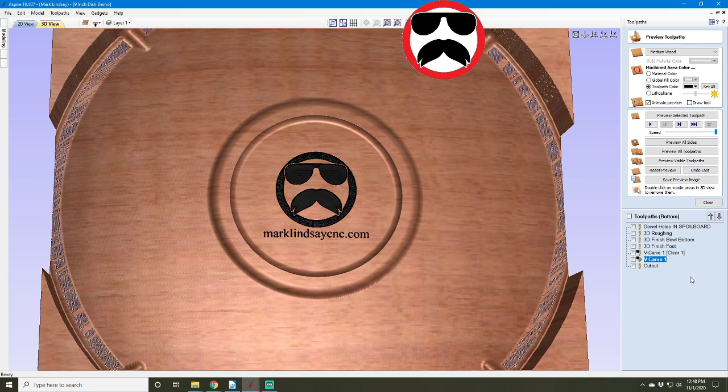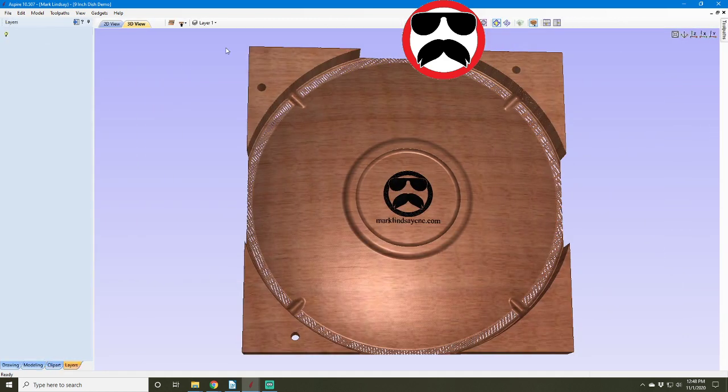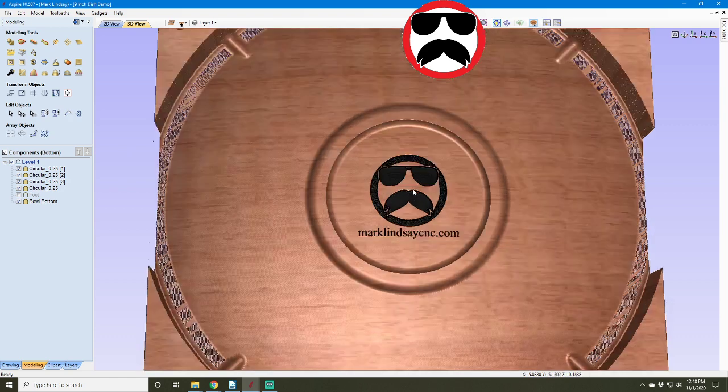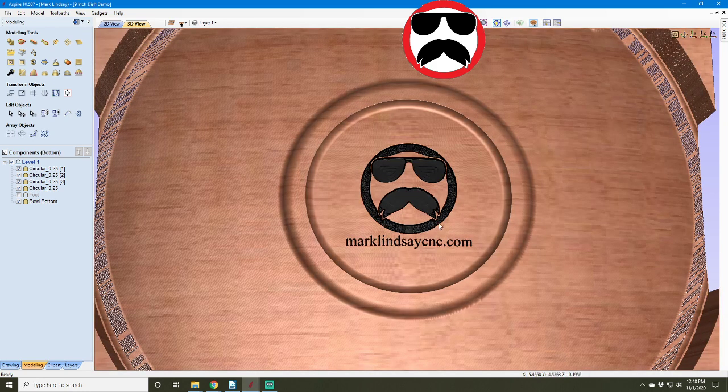So there's the answer, Mario. I don't need to do the video next week. I forgot that I had that foot model turned on. With the foot model turned on, it was reading this surface. It was projecting onto the surface of the foot that I had machined away. That's what was going on.